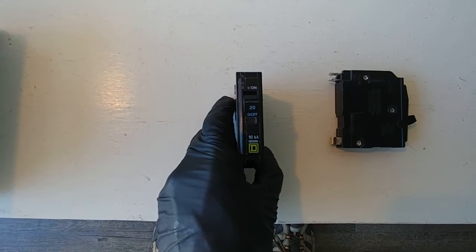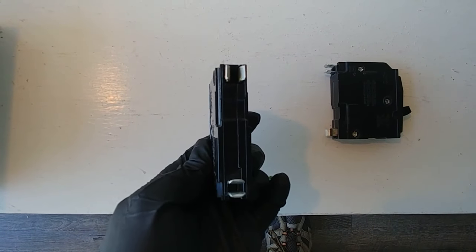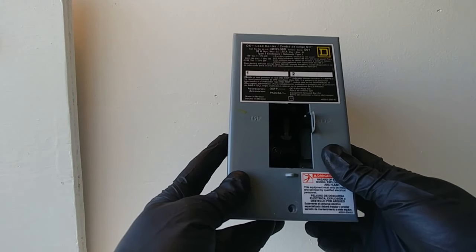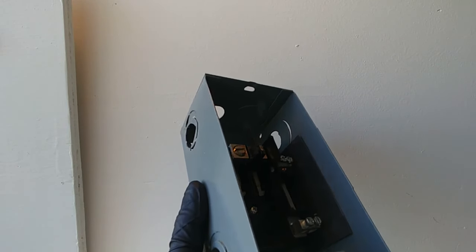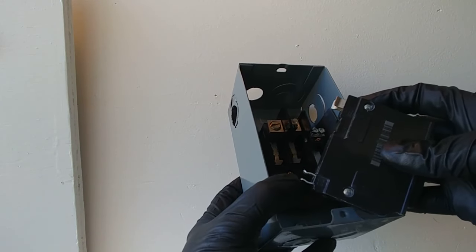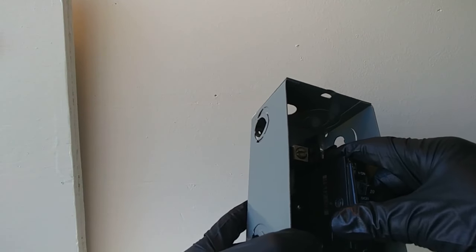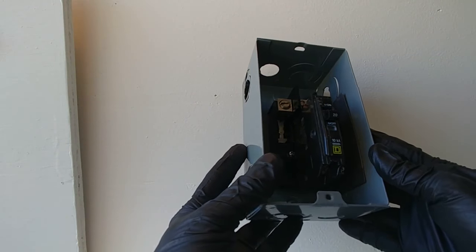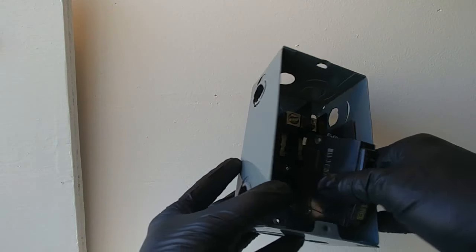Make sure the clips look correct at the top of the breaker — if you don't have them looking like that, they will not fit in your breaker box. I'm going to show you how this breaker fits. The bottom of the breaker is going to snap onto this horizontal pole here. You'll push it in, it'll snap on, then swing it up and push it in at the top and it will snap on. The breaker is installed. To uninstall it, you pull it down and wiggle it, and it will pop off that bottom bar.